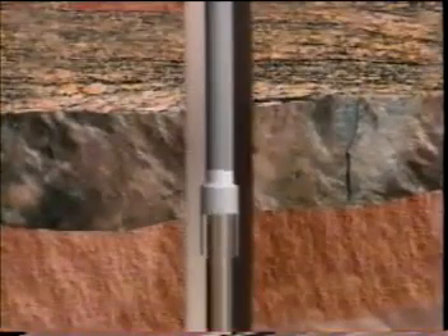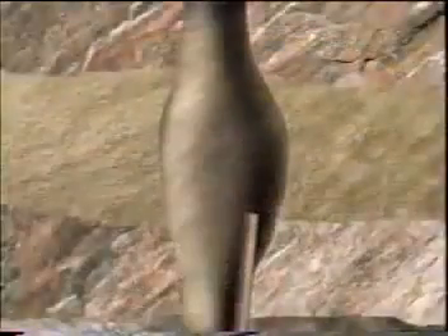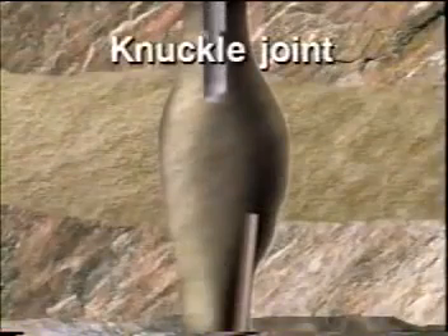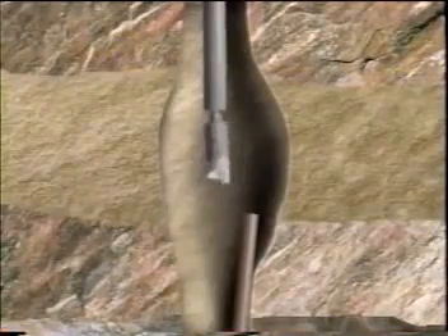Dressing off is achieved with a skirted or hollow fluted mill. Several types of mills are available for this purpose and other jobs. In a washed-out hole, use of a hydraulic knuckle joint located above the overshot kicks out under pump pressure to increase the sweep of the overshot to facilitate capture of an elusive fish.